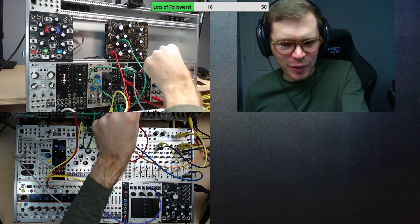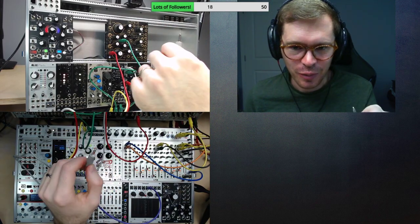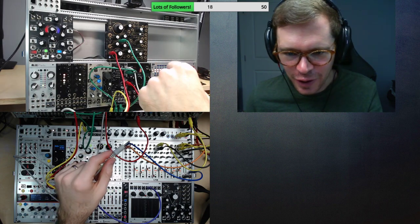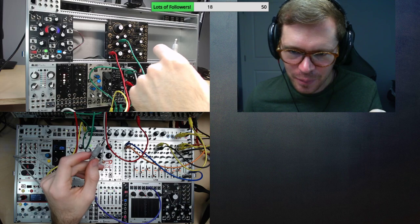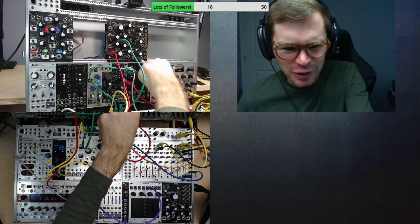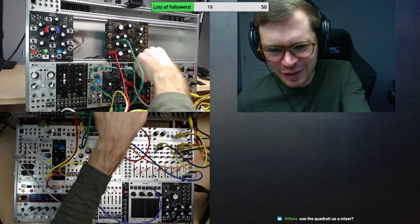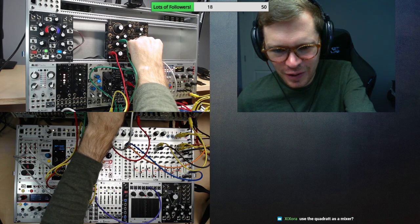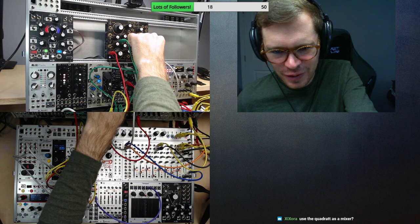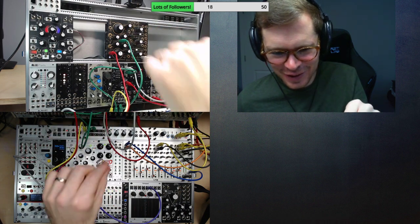This is one of the cool things the CSL has. So on the top, the pulse width modulation output is like what you would expect. It's like a square wave, right? Well, not a square wave, but a variable duty wave, whatever those are called. But the pulse width modulation on the bottom one is like a stepped triangle wave. It's interesting.